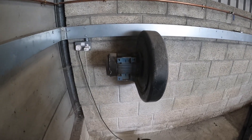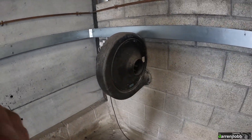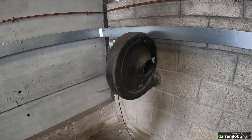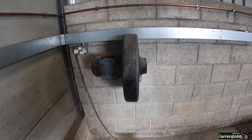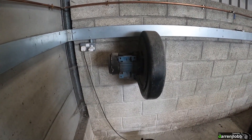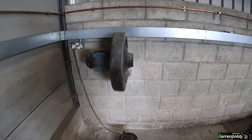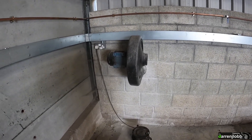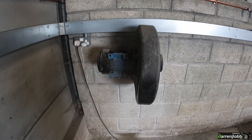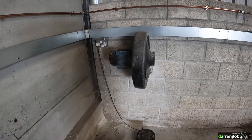Moving on to doing more of the extraction work. You saw me and Chris bore a hole out of the wall in a previous clip, so we need to wire it up. For those who followed this in the old workshop, you'll remember we drove this motor off a VFD, which gave us the ability to vary the speed — really handy because we could idle it down between runs and ramp it up. It's a three-phase motor, so that's no problem.